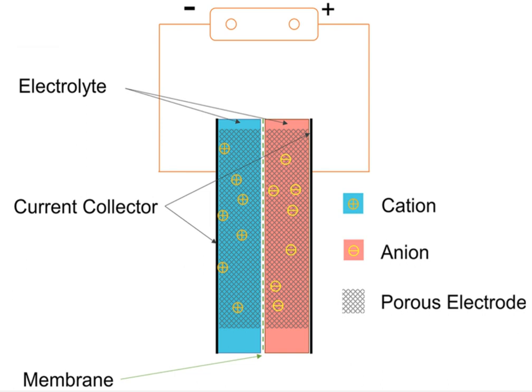The capacitance value of a supercapacitor is determined by two storage principles. Double-layer capacitance, electrostatic storage of the electrical energy achieved by separation of charge in a Helmholtz double layer at the interface between the surface of a conductor electrode and an electrolytic solution electrolyte. The separation of charge distance in a double layer is on the order of a few angstroms (0.3 to 0.8 nanometers) and is static in origin.